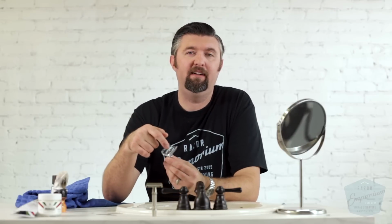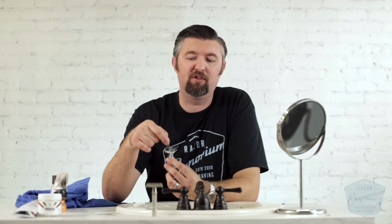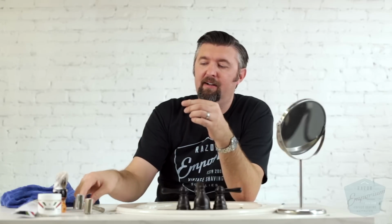And having it be down here in this tiny little area, you're going to end up having to use a Q-tip to really get in there with a metal polish over time if you're concerned about that corrosion starting. It also could compromise the chrome finish over time. Usually corrosion breeds more corrosion, and when you have an unfinished piece of metal next to a finished piece of metal, they can really interfere with each other. So I was not so impressed with that.